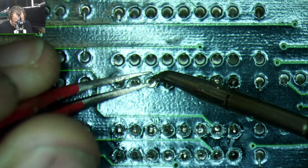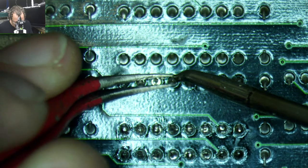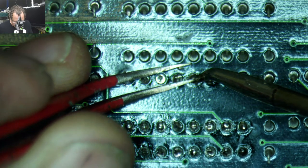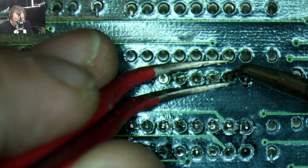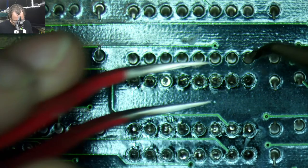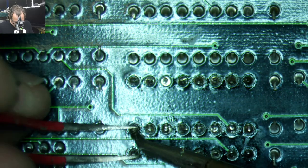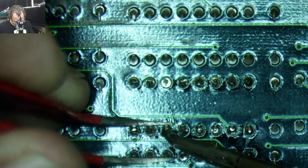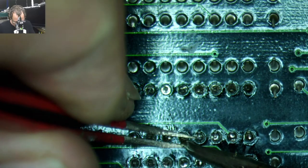So also, if anyone's joined late, hello, and we got the Mac TV to work. There's still caps that I need to get for the TV tuner, so I wasn't able to try that yet. But the Mac TV turned on finally after an ultrasonic clean and re-soldering several of the chips that were kind of gross looking.